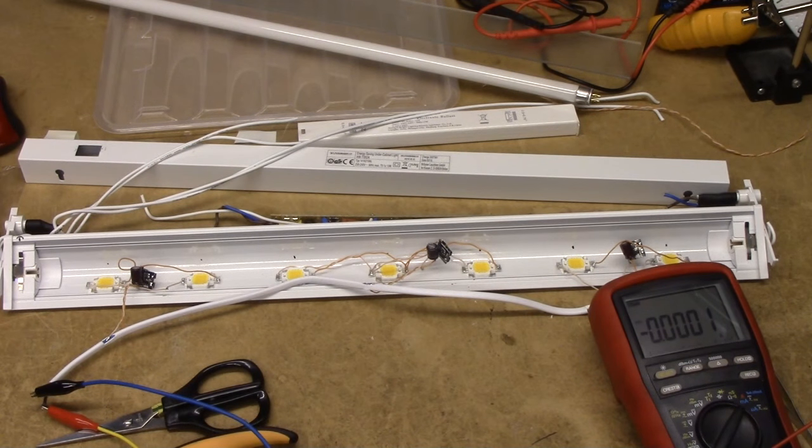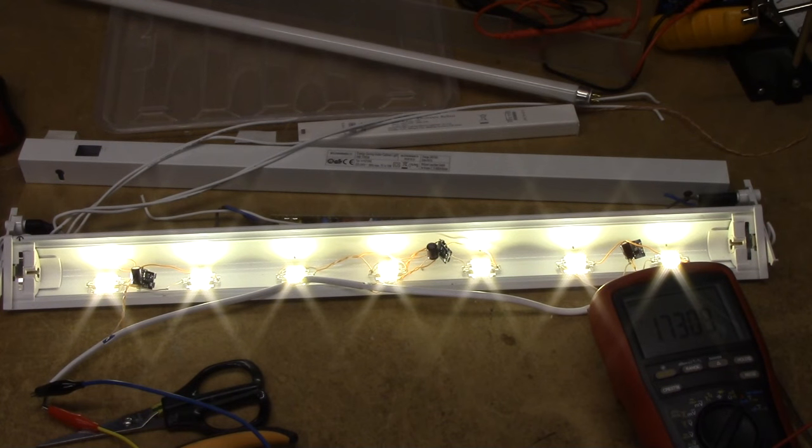All right, that should be everything mounted. I'll check for any short circuits — we've got a current meter hooked up in series — so let's try feeding this thing 12 volts and see what goes up in smoke. Nothing! The meter says 1.72 amps, which means we're drawing just about 20 watts. I tested these LED drivers at just over 90% efficiency when bypassing the rectifier diode, so that gives us an approximate LED output power of just over 18 watts. And it's certainly a shame because I bloody well can't look straight into that — it's blinding.